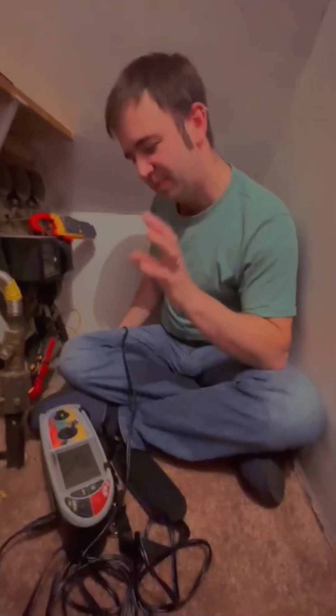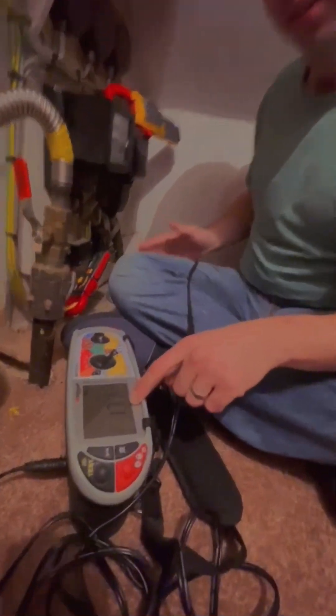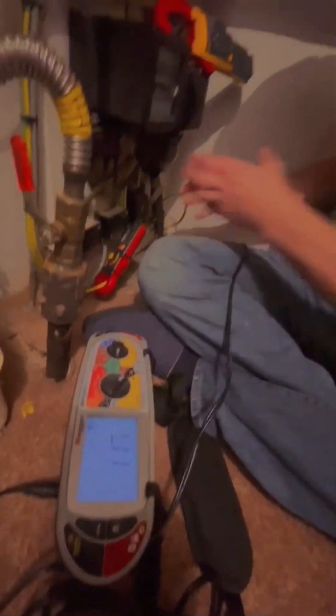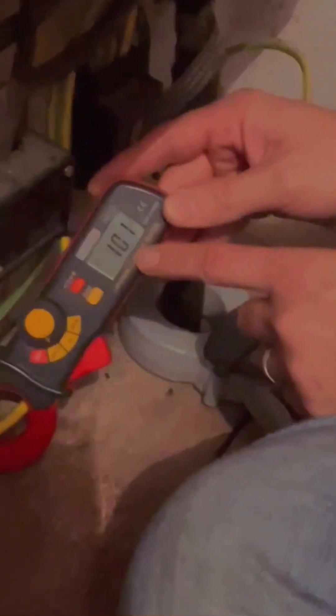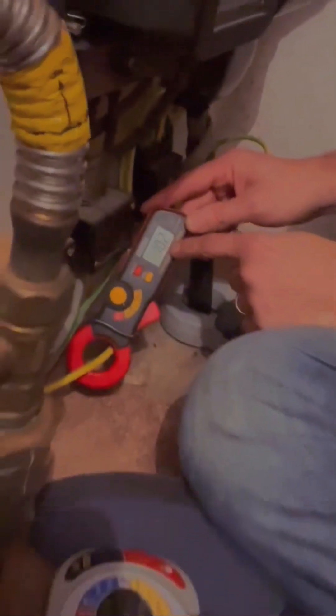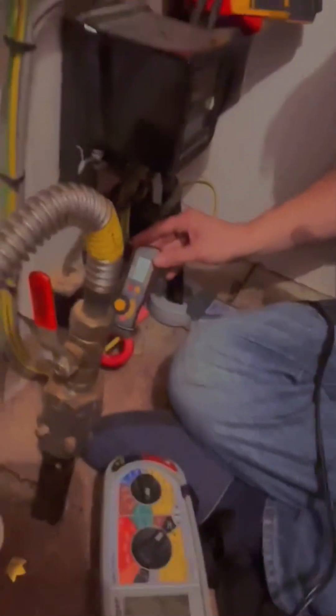What I'm testing just now — you can see the total net leakage is fluctuating wildly, around 18 milliamps. It fluctuates and constantly changes, which is taking in not just this installation but also the street and the supply installation. On just the main earth conductor to the consumer unit it's 10 milliamps and it's not moving — the installation is live and working but it's not fluctuating. That's your protective current conductor leakage.